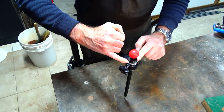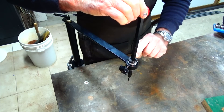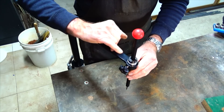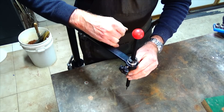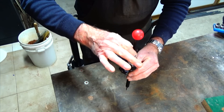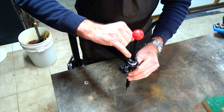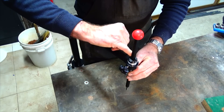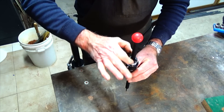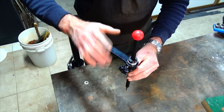This little collar here is just made of aluminium, and the part that the square steel bar slides in is just a piece of 3D printed plastic. 3D printing it means it's easier to make a square hole and you can size the hole so you get fairly accurate movement without any side-to-side movement. I also poured some silicon dry lube down inside that fitting so that it slides freely — if it binds or catches in any way that can make it difficult to lift the pattern smoothly.